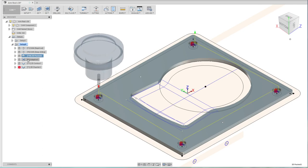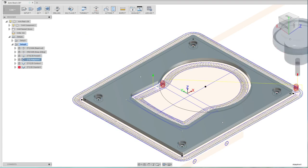Did our counterbores with a 4mm single flute end mill, coming with the adaptive rather than slotting, and a 6mm 3-flute roughing end mill for adaptive on both the outline and the piece in the middle. I manually drilled some holes to hold this down, and as you saw on the video, didn't have enough clearance height, and it nicked one of the screws, which has kind of ruined that tool. But yeah, okay, that's just part of the hazards of doing this.